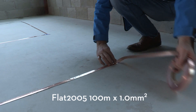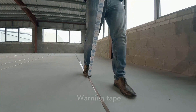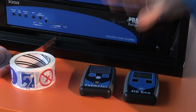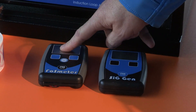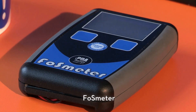This is flat 2005. To seal that down onto the floor, we're also going to be using this warning tape which we'll put over the top and hopefully should stop any carpet fitters from cutting through it. At the end of the system we're going to be testing it. We'll be using a signal generator to put the tones in that we'll need to do the testing, and then we're going to go out into the loop system with the FOS meter which will test for field strength and frequency response.